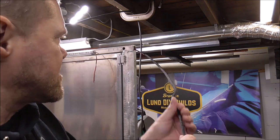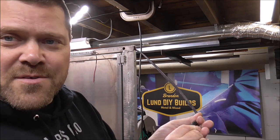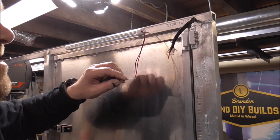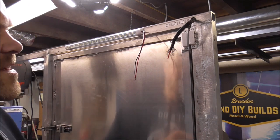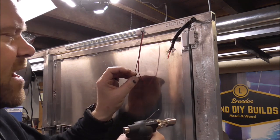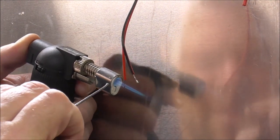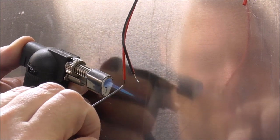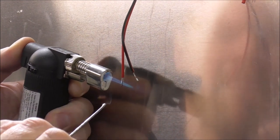At this rate I'm going to be a month of Sundays, so let me get this all pushed back over to the other side, and once it's back out the other end we'll resume. The next thing is tinning the wires — I'm going to heat the wire up a little bit and just drop a little bit of solder on it. That'll make the wire hard on the end so that it doesn't come unfrayed and it'll give it a better connection at the terminals. When you use a flame like this you've got to be real careful that you don't burn up the sheathing.